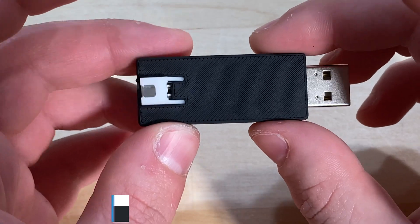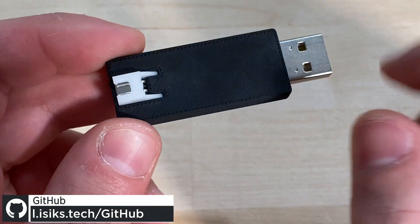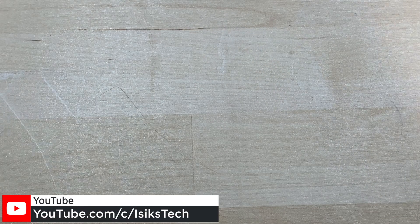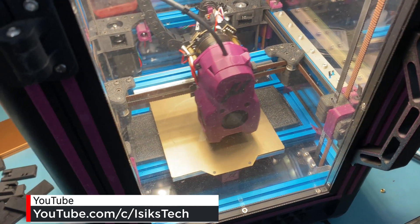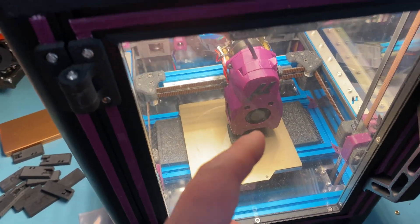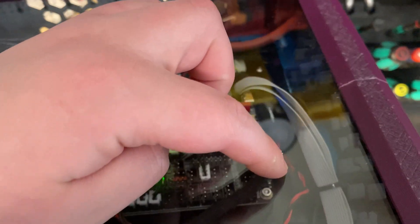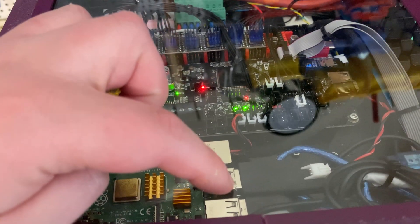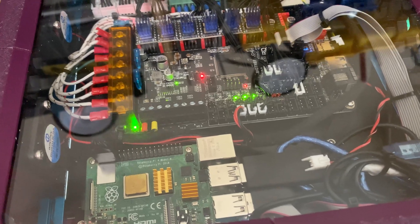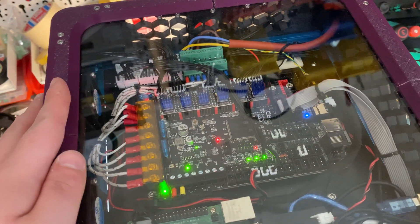I'll also show this in Fusion 360 so you can see how the two parts look together. But before that, let me show this on my Micron so you can see it in action. Here it is — behind that extruder motor there is a BTT EBB36, which is a CAN toolhead board. The wires run up into the top chamber, the yellow and green wire extended with red and black, connected to the Pi Can, which is connected to the Raspberry Pi. I tested all five samples I have and all five work just fine.